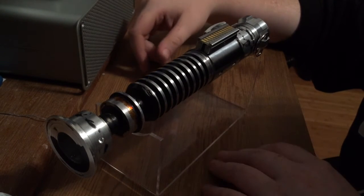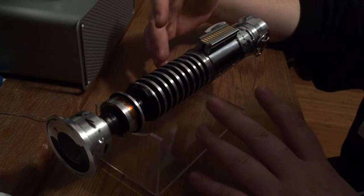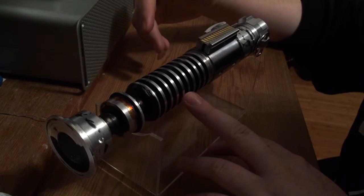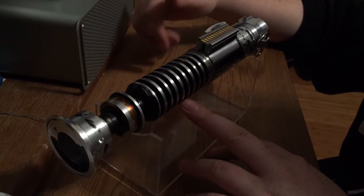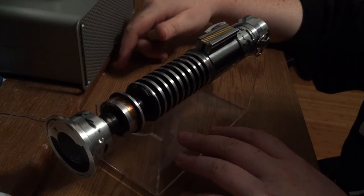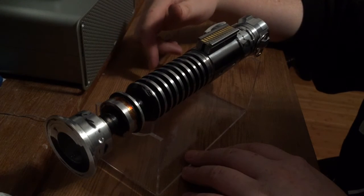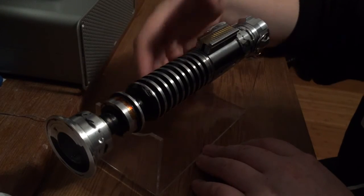Obviously, being a watchmaker, he's got these tiny motors, and we thought: why not make the LED spin? The first version came back with problems — the heatsink module needed more machining, it wasn't working properly, it was stiff and grinding. The spring was too thick and was rubbing against the inside of the saber, so it didn't have that nice smooth spring load. So I did a bit more machining, sent it back to Dick, and told him to get a spring that's not as thick — like 0.8mm wire. He did that, and it finally came back today.